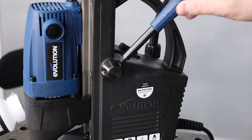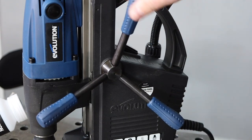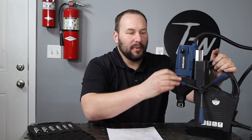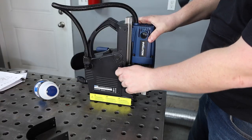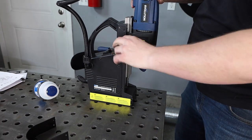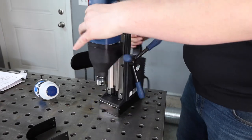Let's go ahead and look at how we'd set this up. First of all, I just need to screw these handles in right here that are going to allow me to move this drill press up and down. This gives you quite a range of motion just with these handles. But if you look on the backside, you can loosen this lock screw and slide the motor up and down an additional track — giving you a lot of height for drilling with a standard twist drill bit and a chuck, or you can move it down low into a lower range if you're drilling with an annular cutter. That's a really nice feature.